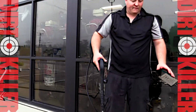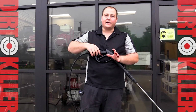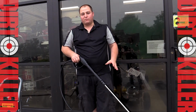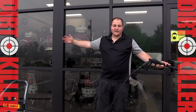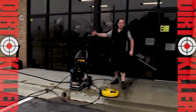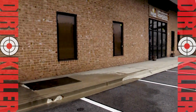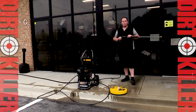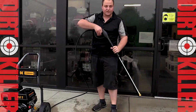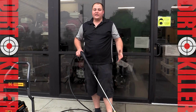All right, so as you can see from that video, in about the same amount of time it took me to do a panel about yay big with just a flat tip, I was able to clean this entire square. The reason that's relevant, if you want to step back and see this entire strip, on average, a surface cleaner is going to save you about a third of the time it will with a wand. You also have the fact that it's way more consistent than anything you're doing by hand, and just the fact that it's way easier on your back.